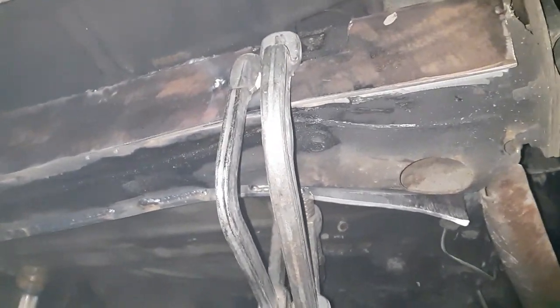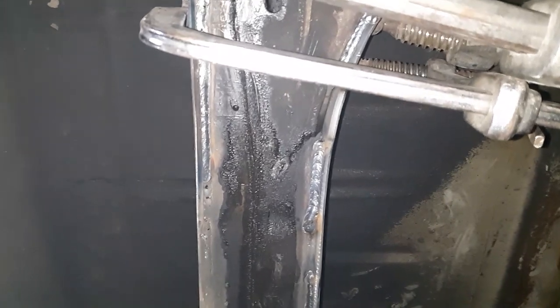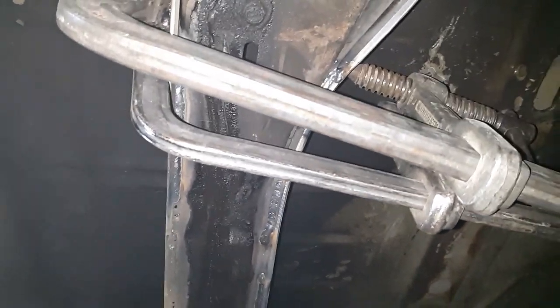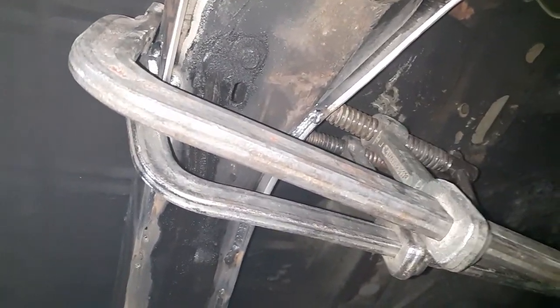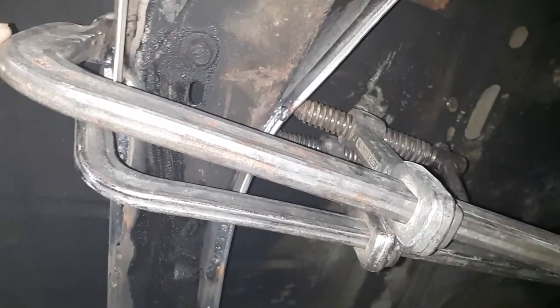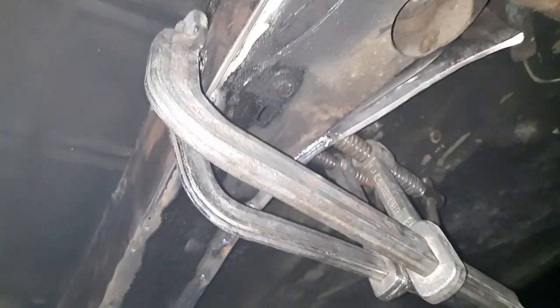You remember earlier when I was saying a cheap clamp can be a good clamp because you can weld to it. Well, that's what I had to do on this one. It wasn't the easiest getting that bend, welding the cheaper one to the frame. Kind of got the bend in there, but couldn't quite get it closed good enough. So I used my bigger clamp on top of my smaller clamp. I kept wanting to pull back that way. So I used my cheap clamp to brace my good clamp and pulled it all in. Sometimes you just have to think outside of the box.